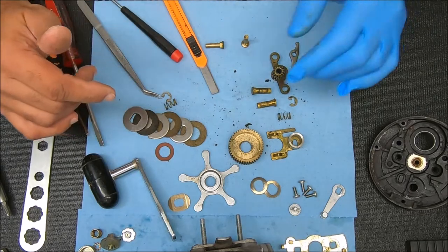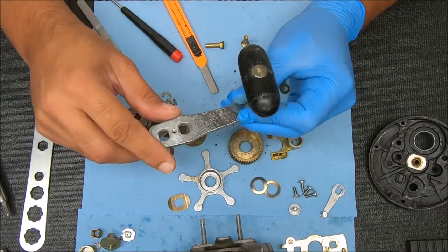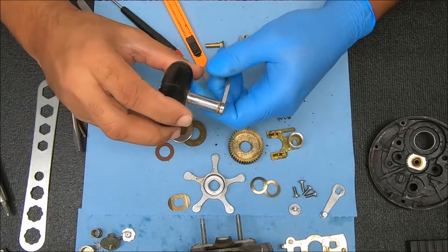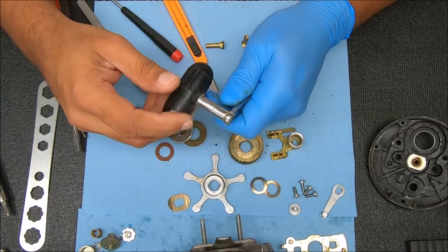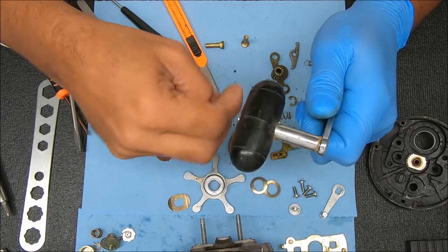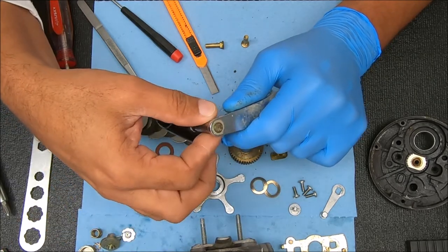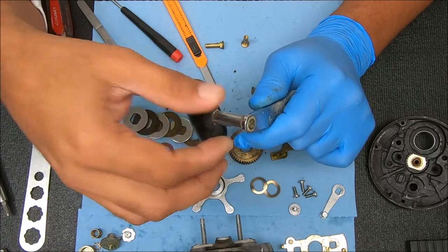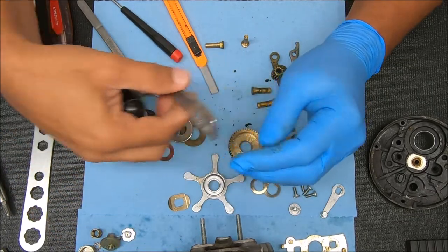That's how it looks. Alright, I'm going to cut this, get it cleaned up, and come back to you guys. I'm going to use the steel wool on these chrome parts to clean them up so they look a whole lot better. Also the handle is a little stiff — what I would do is add some oil here. If it's still fairly stiff, I would use a little bit of heat right here to break up whatever is locking that up inside, even if it's rust. Then spray some more Corrosion-X or oil inside there — it works inside and stays inside and prevents that rust from reforming, so you have a handle that works for a good long time.